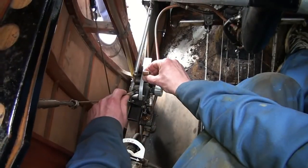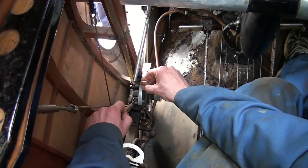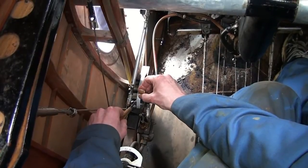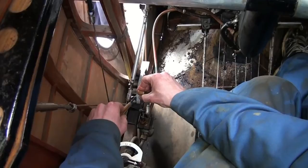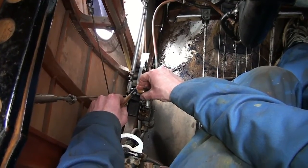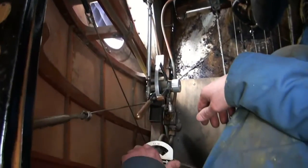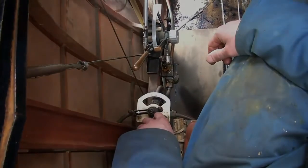And then to stop it, bring them both back down to idle — the air will be back on its stop there — and then I'll just very gradually bring the fuel out of it, and the revs will start to die down. As soon as it stops firing, I'll turn the switches off, then turn the fuel back to off, and that's the engine run complete.